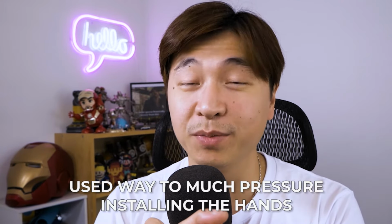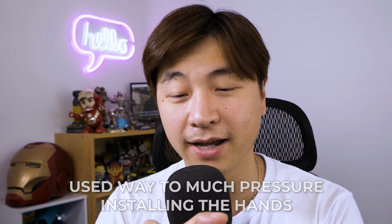Wow, that was an interesting ride, and I hope you've learned something from my mistakes after viewing all the terrible things I've done, but I can list it out for you if you didn't catch everything. Number one, I used way too much pressure installing the second hand. In addition to that, I was supposed to wait for the stem of the second hand to actually attach to the pinion of the movement before applying any pressure. I've learned that afterwards, obviously. So don't do what I just did.